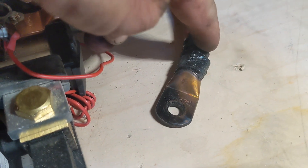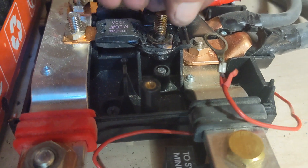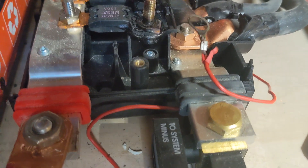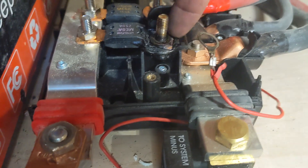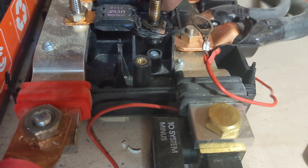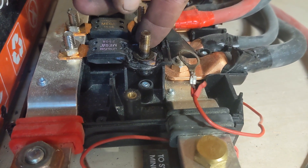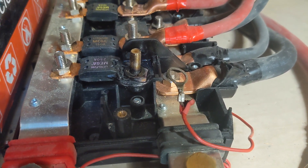This terminal lug — the positive to the inverter — was connected to this fuse right here, and the nut was just finger tight. Because it wasn't tight it didn't create a good connection. Even though it didn't blow the fuse — not too much current — this ring terminal right here was so loose that it was arcing. There's a lot of resistance, that creates heat, and it melted this terminal. This is what the customers experienced.